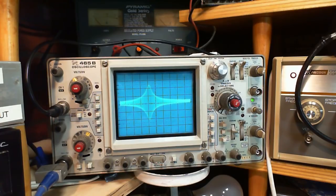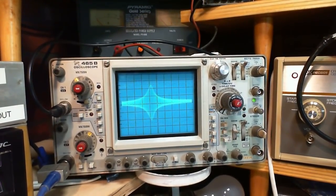Hang on a second here. There, let me set it where it's highest. Now, I'm not saying this coil or transformer is behaving exactly as it would in a radio. The test instrument has impedances. My scope is a high impedance. The output of the sweep generator is a very low impedance, 50 ohms. Maybe that's disturbing the way the coil works in there. So that didn't do much in terms of changing the frequency.